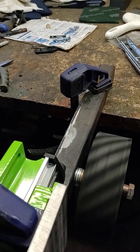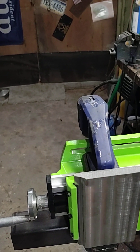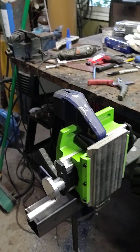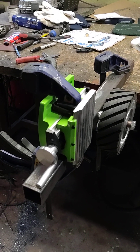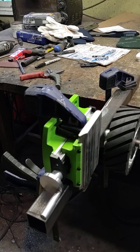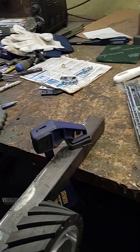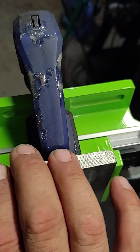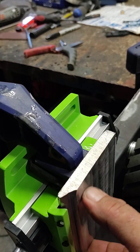When you make something like this you want to be able to move inward, and you also have to go up and down. All the videos I saw had like a $200–$300 piece of equipment, but I found this little machinist vise — it's a dual-axis vise, it had the X and Y axis. What I did is I took the tray off of it, took this piece of metal I had in my metal box, and used my milling machine to mill it down to that thickness, mill the bevel on it, and the set screws hold it right in place.